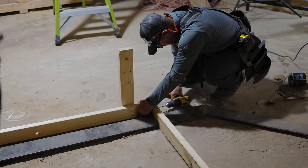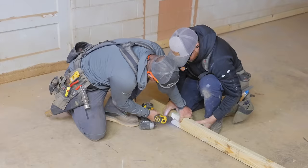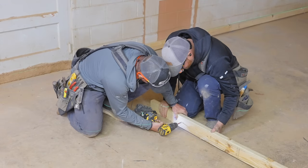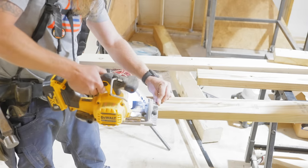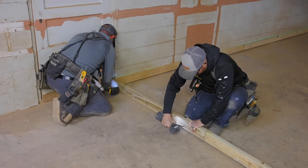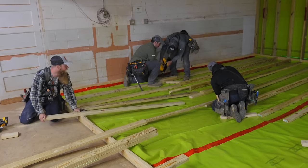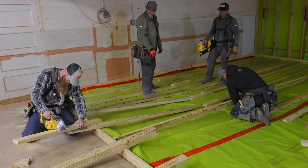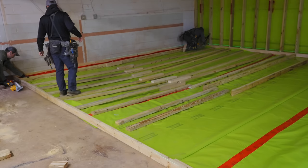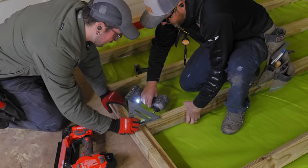We used spots where we needed to scab two boards together to our advantage — offsetting the blocking downwards to bring the band board up to our laser line, which worked great for leveling the front band board. The very last board needed a slight trim where the slab was higher in front of the door opening, and after trimming we wrapped up the perimeter of the platform. I used treated 2x4s and couldn't find them in long enough lengths for this 20-foot-deep platform, so we scabbed two boards together to get the joists, then attached them to the rim joists — toenailing at the back wall and screwing through the face of the rim joist at the front.